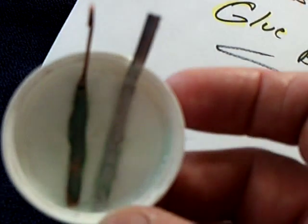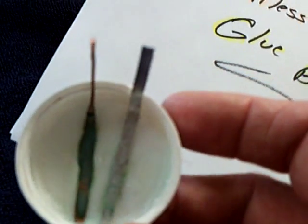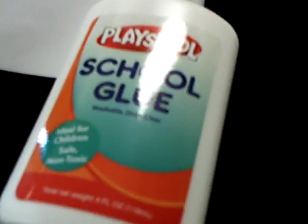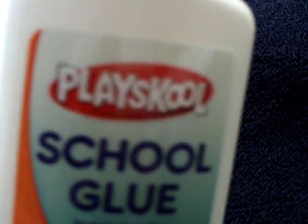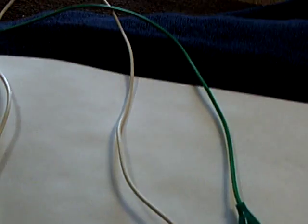That's why this works. Without the water this isn't going to work at all. I've realized that you have to have the water molecule to make these galvanic cells work. It just uses a white glue — I got this tube of glue for a buck at the dollar store. It's the same white glue you use in carpentry and wood projects, water based. You have to let it set up and have it in a very thin layer.